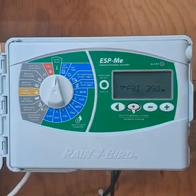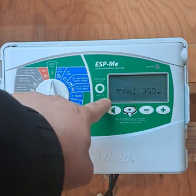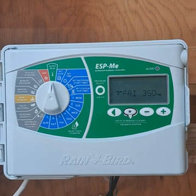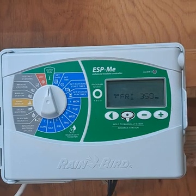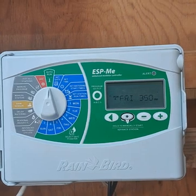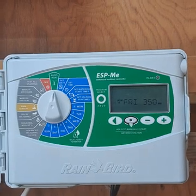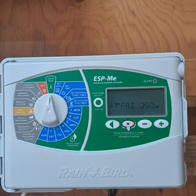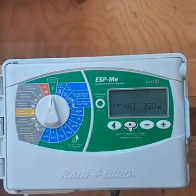In the center, on the left-hand side of the screen, you see buttons labeled A, B, C, and D — those are the different programs you can set. You can have up to four different programs on this controller, meaning you could have it watering four different areas of your yard and garden at four different times. For example, on program A you might water your lawns twice a week at 4 AM, and on program B have your drip system run every day at 9 AM.